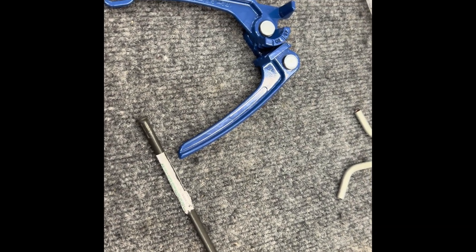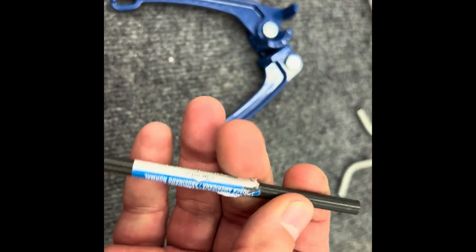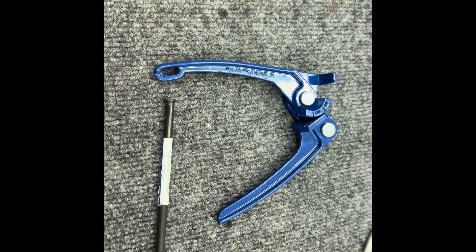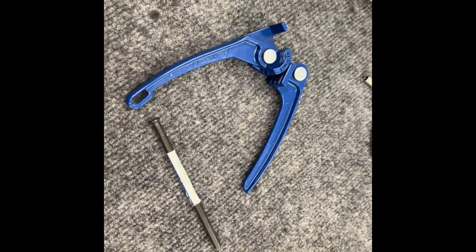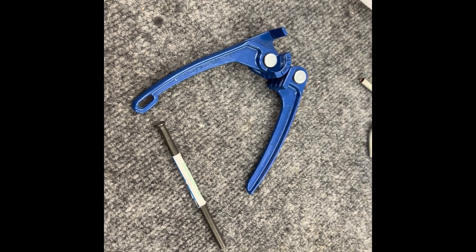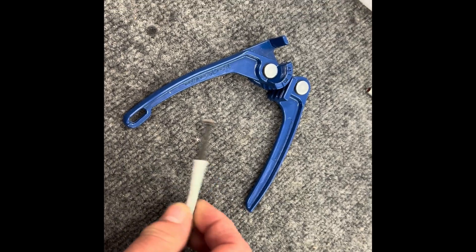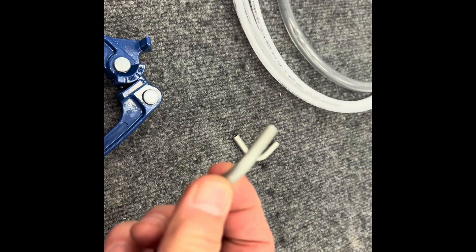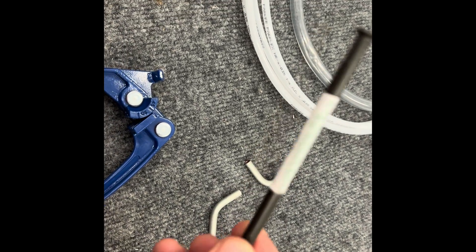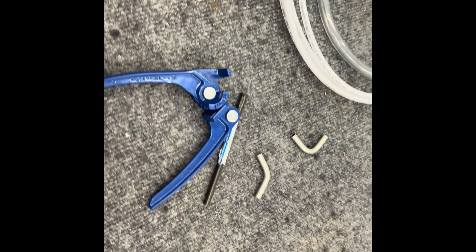It turned out really well and I'm pretty happy with it. The other thing was this has some sort of anti-corrosion coating on it, and when I put it in the bender it just popped off. So I sanded it down and sprayed high-temperature silver paint on it. I figured that would be a little bit of a radiant heat reflector and give it some increased corrosion protection. This is just bare steel — I don't know if corrosion is an issue with the one Sling provides — but because it was black, I wanted to make it silver again. Maybe an unnecessary step, but it only added a couple of minutes.